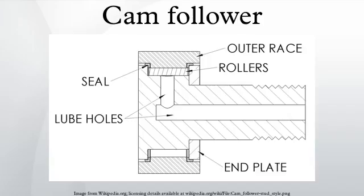Depending on the exact design, sometimes two rollers are put in each pocket of the cage, using a cage design originated by RBC Bearings in 1971. For heavy duty applications, a roller design can be used, which employs two rows of rollers of larger diameter than used in needle roller cam followers, to increase the dynamic load capacity and provide some thrust capabilities. This design can also support higher speeds than the full complement design.